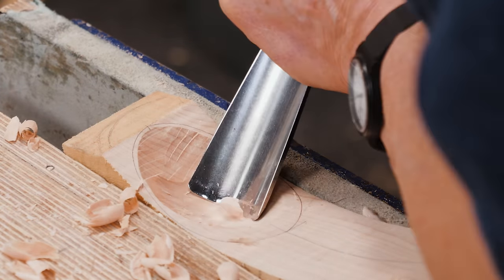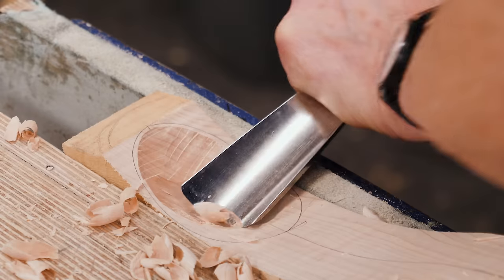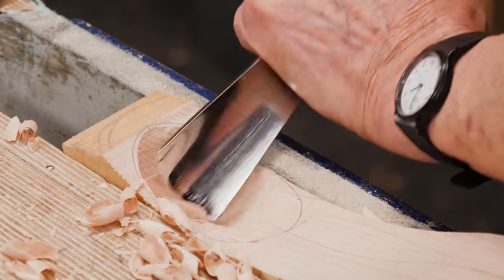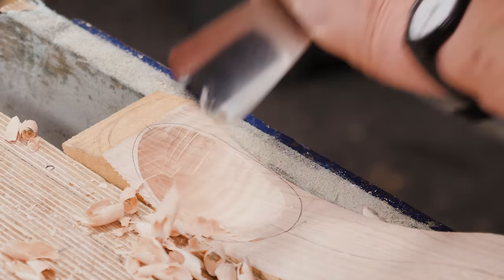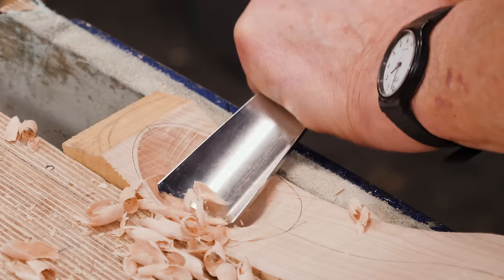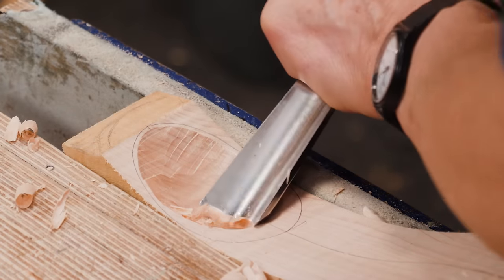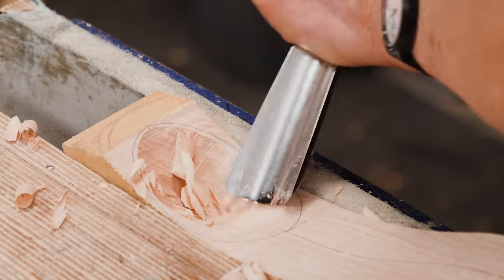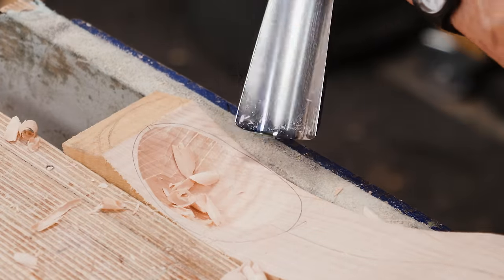This works really fine. In green wood this would go a lot easier, but I'm starting out with dry wood because it's already dealt with shrinkage and I won't get any splitting normally associated with green wood. If you get the drying wrong you might end up with a cracked spoon — or an egg separator.